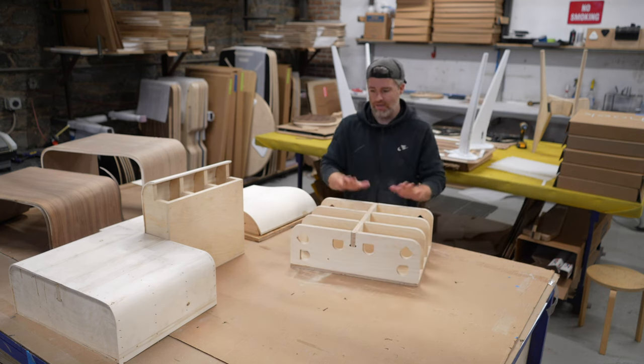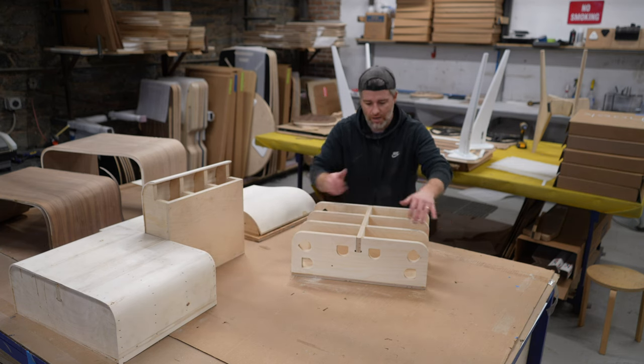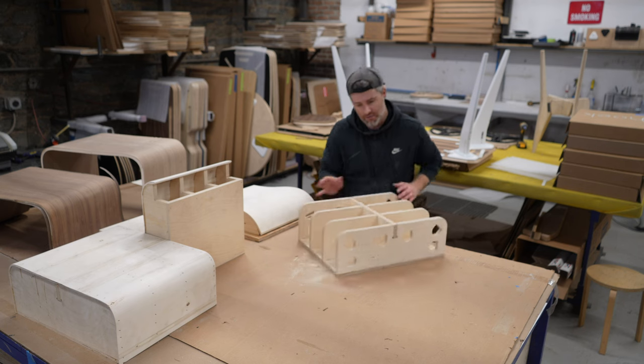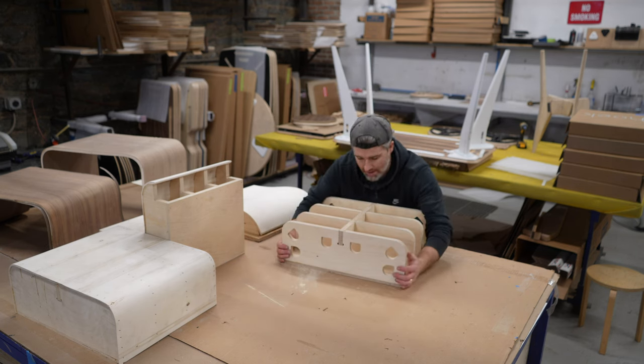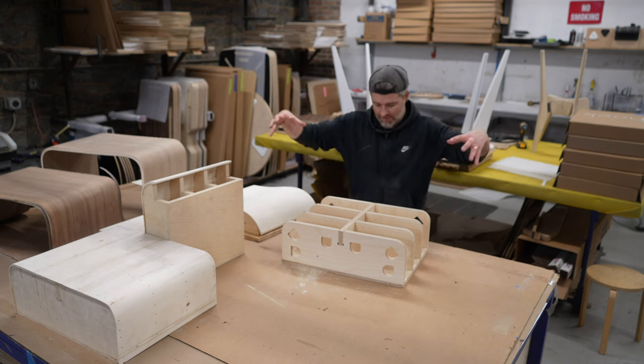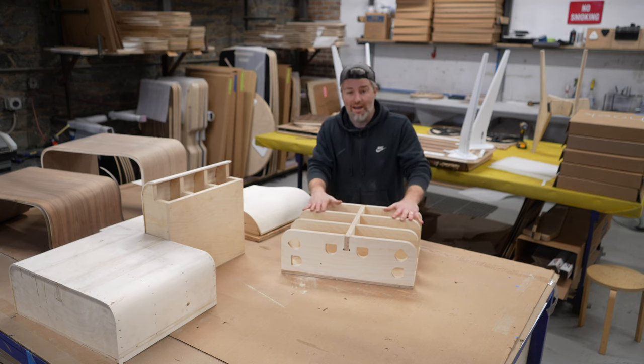And in reality, all I need is this or this, and I put the bendy ply and the veneer over the top, just tape it so it stays in place, slide it into the vacuum bag, and the vacuum bag should suck around it and replace the jig at the top. So that's what I'm gonna do today. I'm gonna try it out,